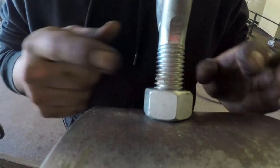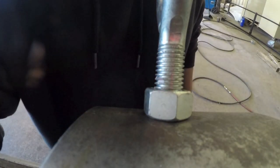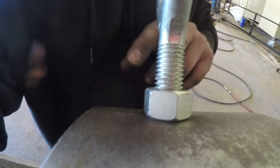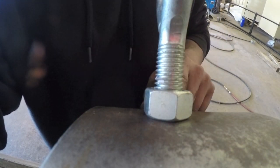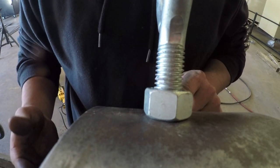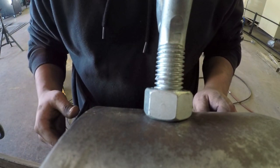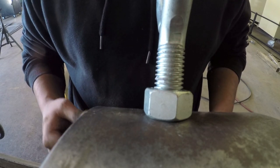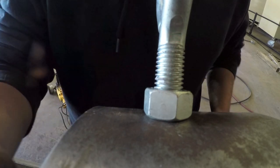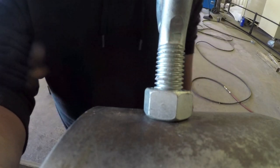Now while I remember, while this thing is in, I'm going to go ahead and turn off the power to the lathe, because if this thing spins by accident, I know it would take a lot for it to actually get the machine turned on, but if for some reason it did, somebody didn't realize this was in here, it would really tear some things up. So I'm going to go ahead and disconnect the external power to the machine.